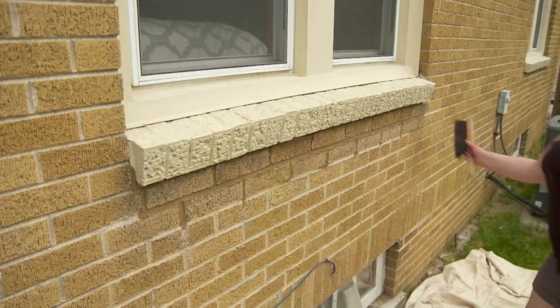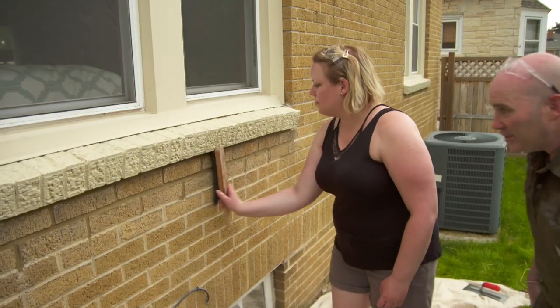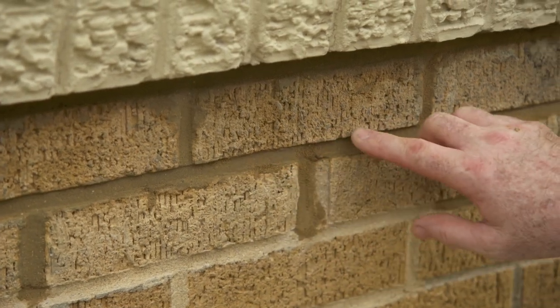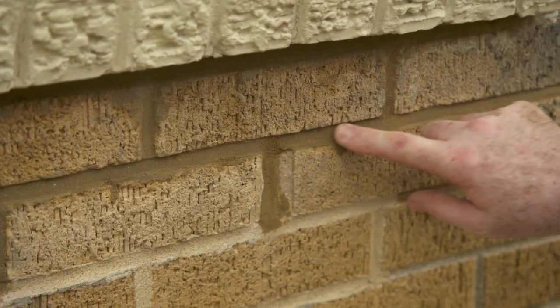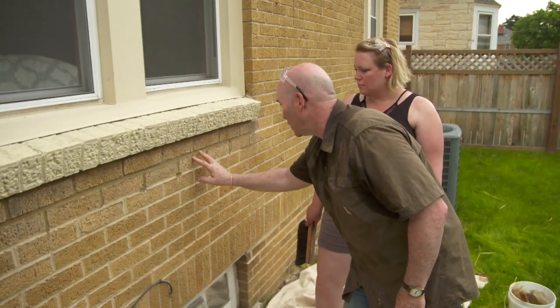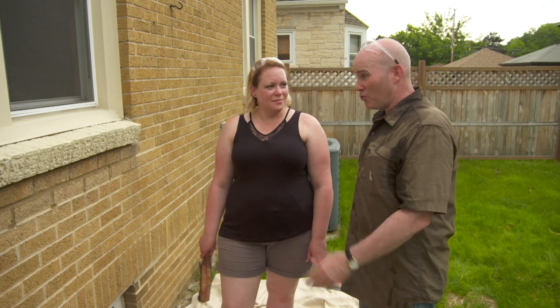The final step is to use a horse hair brush, brush off all the excess, and blend the mortar. Looks great — I love the way you stayed off the edge of the brick, just like the original work. Don't worry about the color; it'll all cure in four to six weeks and cure together. We have a great blend going. You did your first masonry project — great job. It was a lot easier than I thought. You spend about 75 bucks on some tools and material, get a day out here, do what we did, and you've got something behind you.